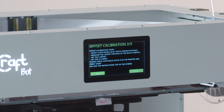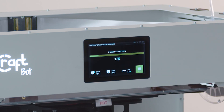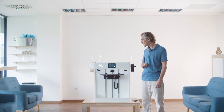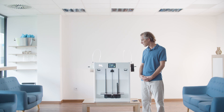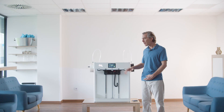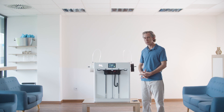This screen explains a little bit about what's going to be happening next. First it's going to be measuring the lowest point on the print bed and setting your Z calibration. Next the printer is going to heat itself to a printing temperature so that all the measurements are accurate. After it's done heating it'll detect the edges of the plate, set the Z calibration, and then we'll move on to XY.